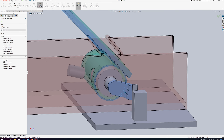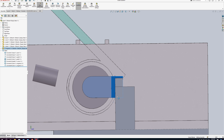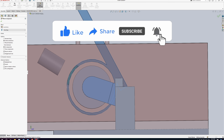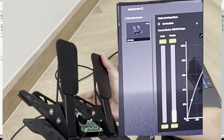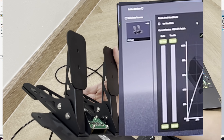The most simple fix is to move the magnet closer to the sensor. What you should do is: when you press all the way down, the magnet should end up right here. You can adjust this magnet using the nut and move it so that when you're not pressing it's in this position, and when you press all the way it's here. Since it's now closer to the hall effect sensor, the resolution will be very high — like double or triple what it was before.